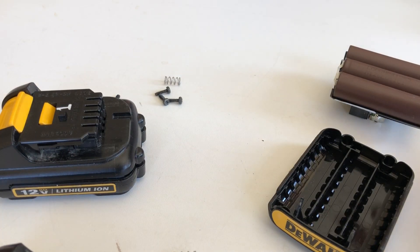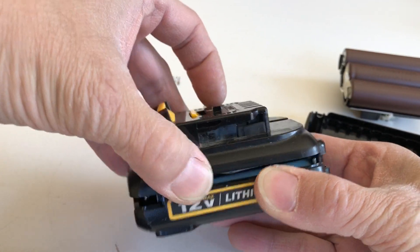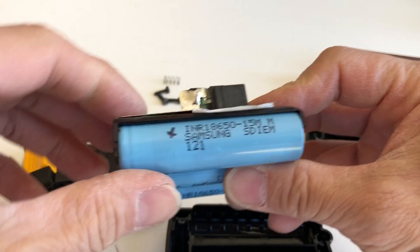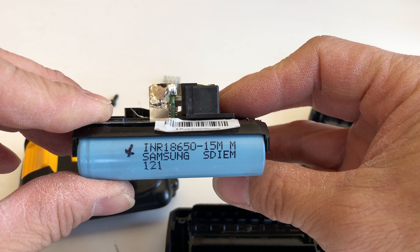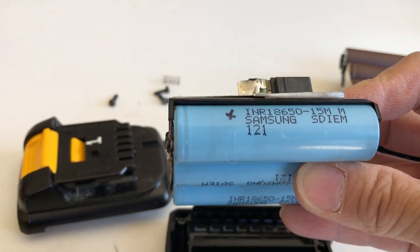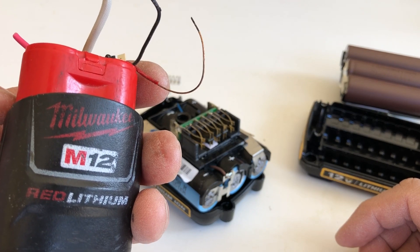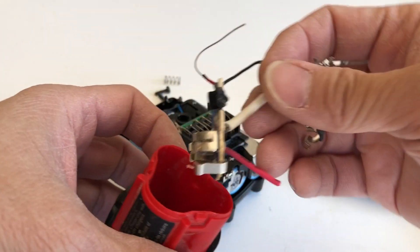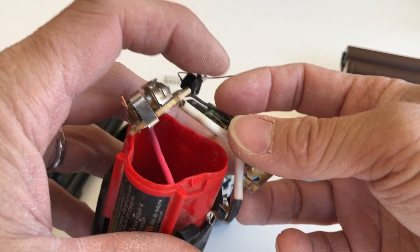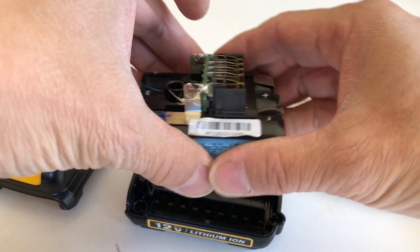What I did was I had another set of three 18650 batteries. If you notice, the cells are blue — they are not LGs; instead they're the Samsung INR series, also very high amperage for power tools. I got these from a Milwaukee M12 pack that I cannibalized. The batteries were still good but one of the charging terminals had broken, so I took apart the cells, removed the spot welds, lined them up, and resoldered them into this DeWalt pack.